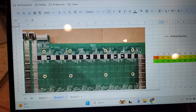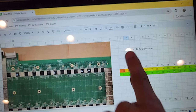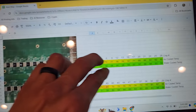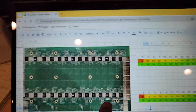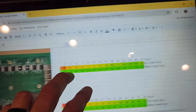Here is a chart I developed — a heat map to see how the airflow over a hash board affects the chips. This is lined up with the chipset physically — the next row lines up with the next chipset. So these are basically a physical match and layout of the board.